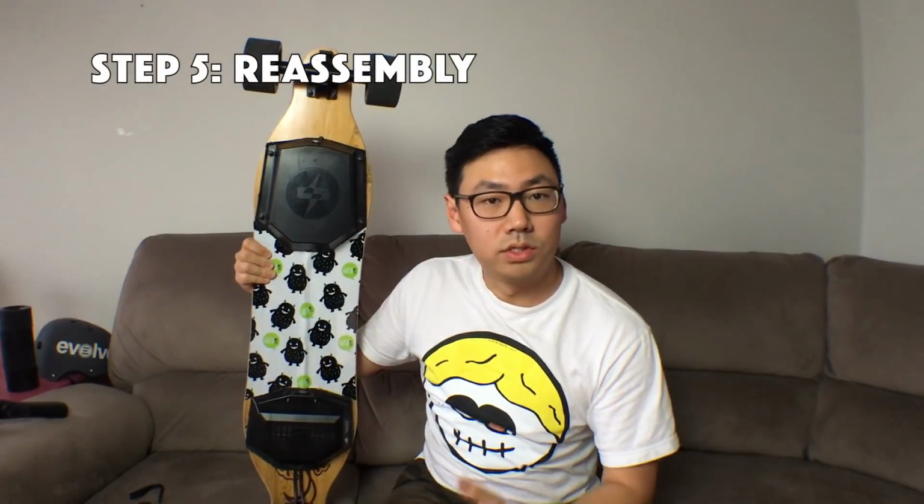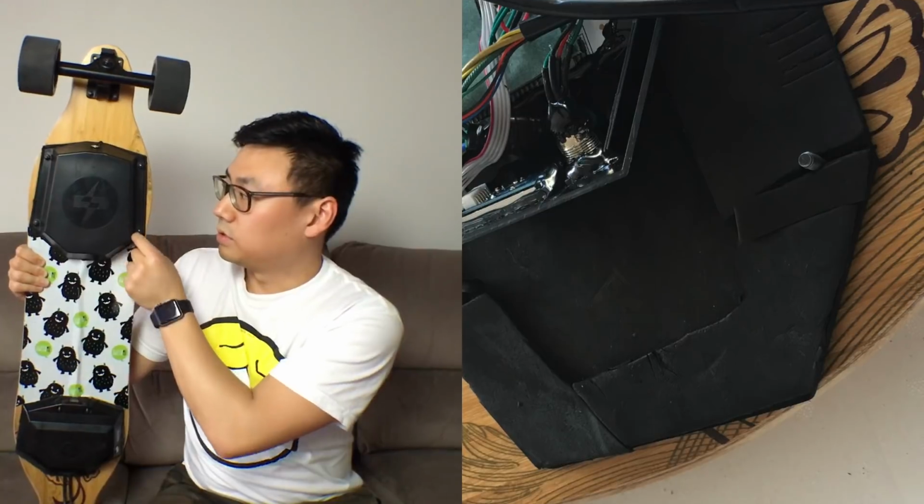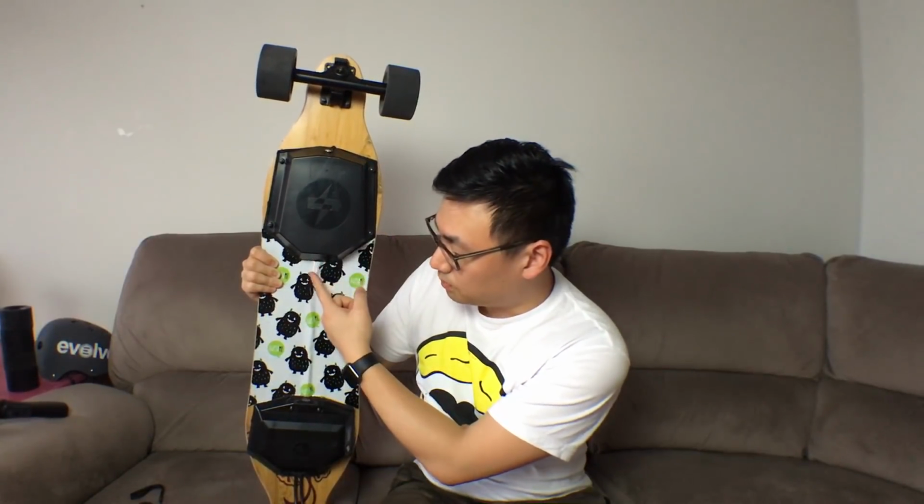As you begin to install the components, be sure to use extra foam that you got from the original Meepo, and put extra bits, especially on the sides for this deck, just so that you do not have any gaps and it keeps your compartments more waterproof. The extra foam should give your power cable enough room to just be squished underneath the compartments, but I cut small grooves in the plastic just so they fit better.